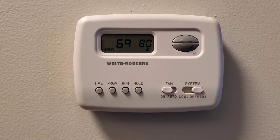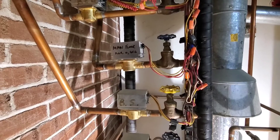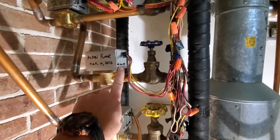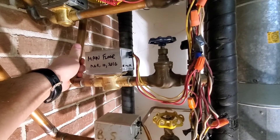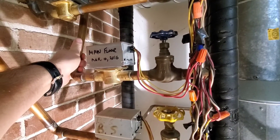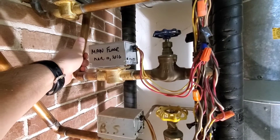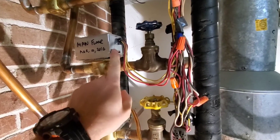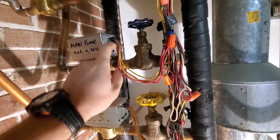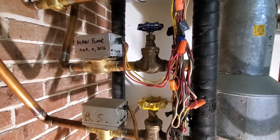We'll go down and check the boiler. The middle zone valve should be calling for heat right now, so this handle should be loose with no tension on it. The pipe is not getting hot, but the handle was not in the auto position before. The boiler should be kicking on as well, and it hasn't. So the thermostat is calling for heat, but this zone valve isn't operating — and that is what the issue is here.